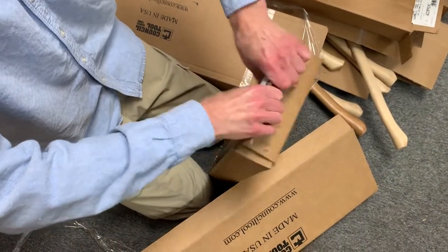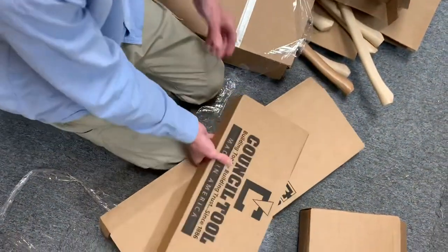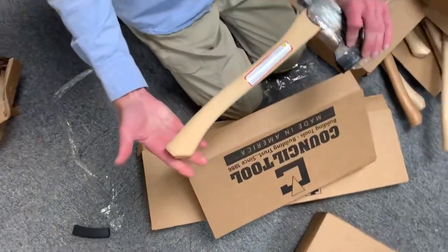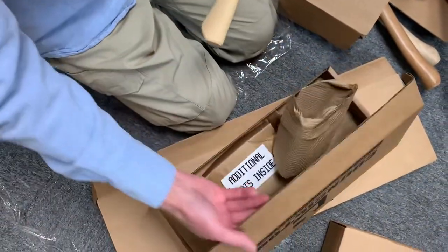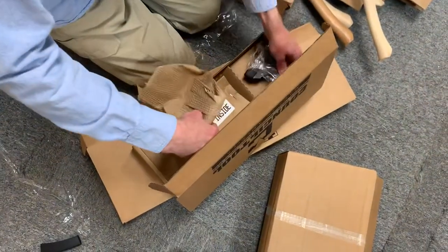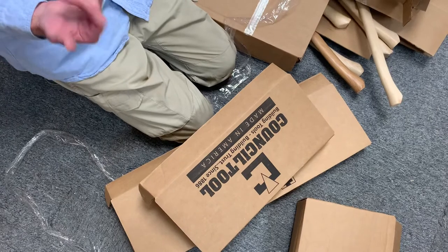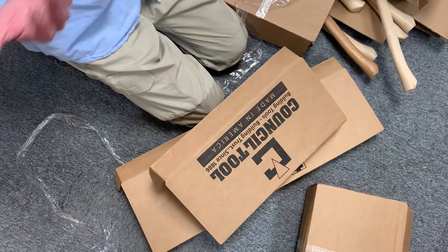On the more expensive axes the handles are nicer — it's a nicer grade of wood. When you buy an axe handle graded as A or C, that's the grade of the raw piece of wood. A-grade gives you a nice light-colored piece with pretty straight grain. It's always going to be a pretty nice piece of wood on the premium stuff. But sometimes you take A-grade wood and put it on the lathe and it comes out looking terrible. Sometimes something ugly on the outside has a great-looking handle on the inside. That's why sometimes on the lower grade you have a great-looking handle and on the higher grade it's two-tone.